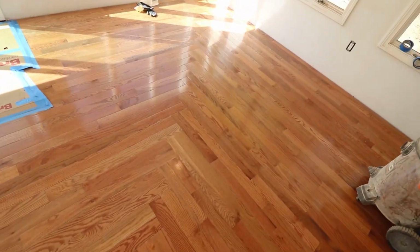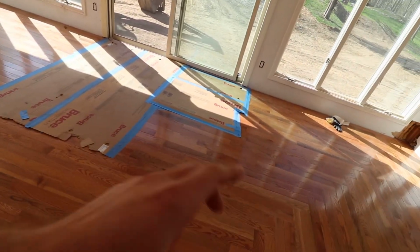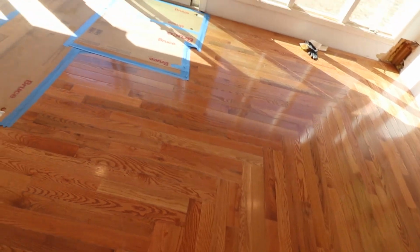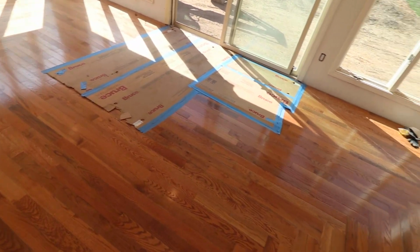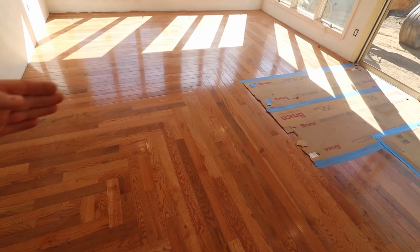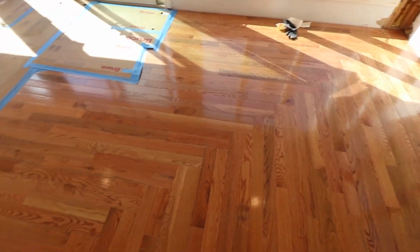When we first bought the house, if you walked anywhere on the left or right side of the center beam in the basement, you would actually feel a sponginess, almost like a little mini trampoline. It was very odd feeling. So we have a weight-bearing beam that came with the house here, but what we did in the basement, I put a weight-bearing beam here, a structural beam there, and a structural beam there, with posts and proper footings. And now this room is nice and stiff.